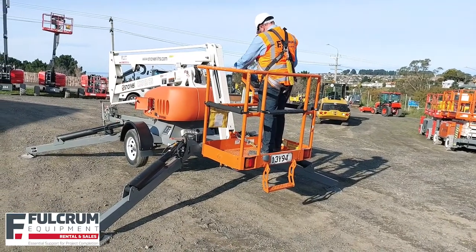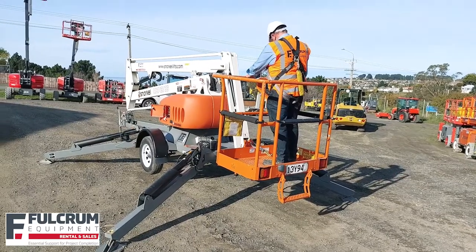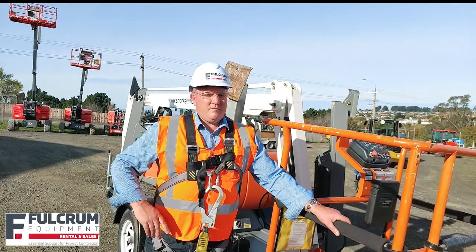To lift the legs — because as soon as you have lifted the stabiliser legs, you are then unable to adjust any of the top booms. So those are a few simple tips on how to operate the cherry picker. Now you know!